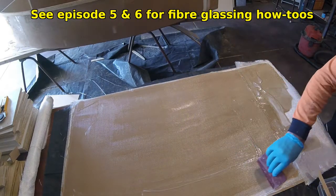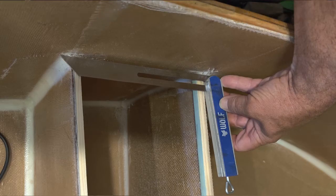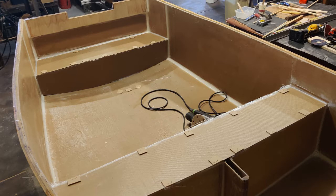If we're going to put a seat in something like this, we basically treat the MDF as panel. I measured up the MDF for the size and shapes of the seat tops and sides, laminated both sides before doing anything else, then trimmed the laminate. I put a 10 by 10 millimeter pine cleat on the inside, glued it with epoxy, installed it in the boat, and put the top on. I pinned through small MDF squares using a pin gun — you could use thin brads and a hammer — which lets you pull the nails out afterwards and fill the holes. You don't want steel nails in your boat.